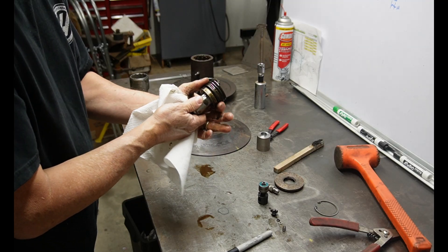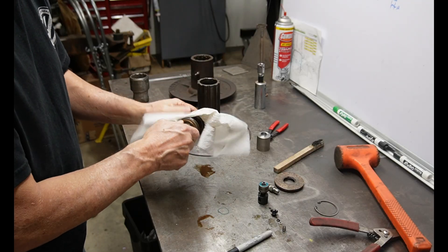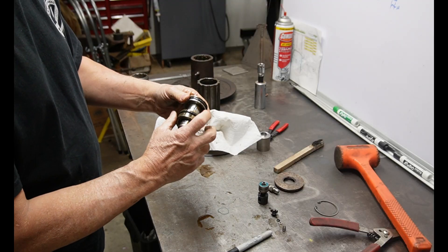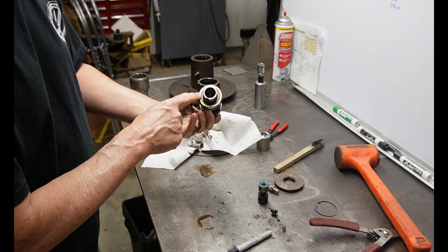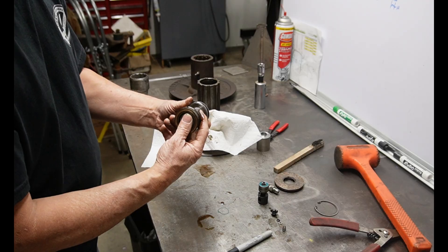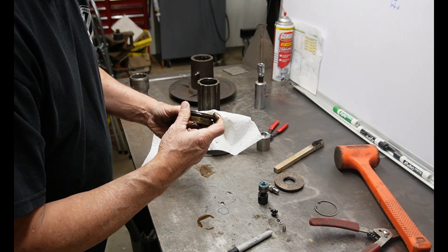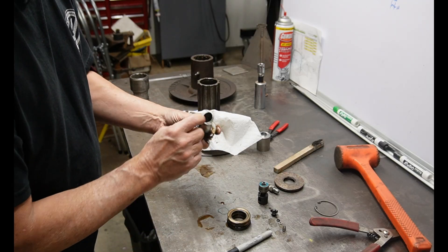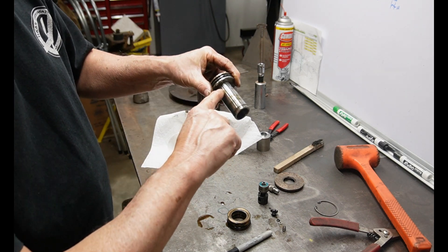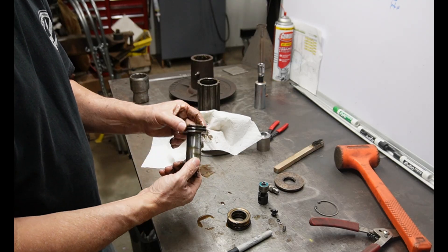Lots of pieces — it's a pretty complicated setup when really it's just a hydraulic cylinder. But it's spinning, and you can't just put an O-ring on something that's spinning at 3000 RPM — it'll just melt. That's what the carbon seal's job is. So I popped this piston apart. You can see a couple of the O-rings — there's an O-ring here, an O-ring here, and there's another one between here and here on the inside. There's also a cross drilling from there to the inside, and that's where the oil enters to react from the piston.